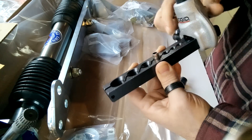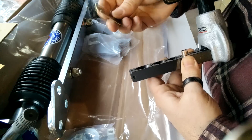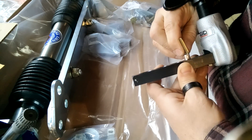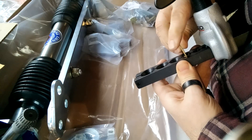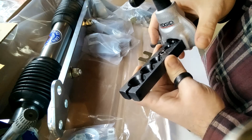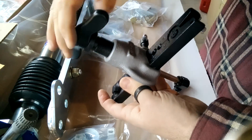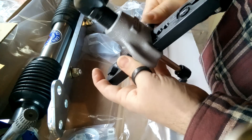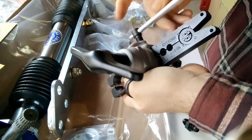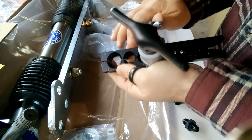The hard line simply goes in here and you want to make sure it's flush with the top of the tool. I push it down until the copper line is level with the top. Then you slide the upper part of the tool over — you lock it in place first, as it has notches along the sides. You find the notch for your line size, and this simultaneously clamps the tube in place and keeps it from moving while you're flaring.